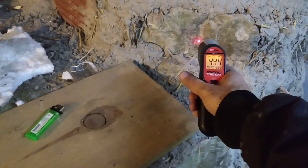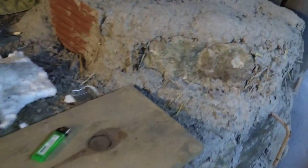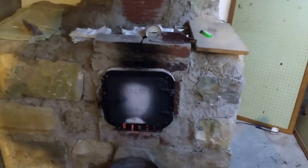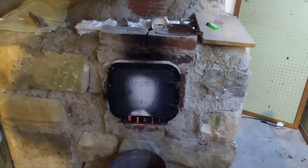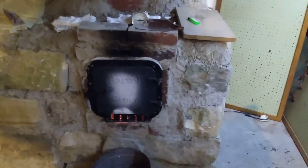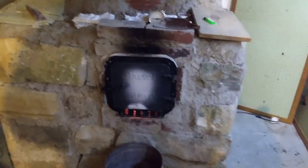This one's only about 3 inches thick and it's already 101 degrees. It's 230 degrees now — warming up pretty quickly. The stove itself performs really well. Materials are brick, limestone, clay, ash, ceramic fiber blanket for insulation. Underneath the base of the firebox, under the brick, I used rock wool mineral wool insulation. It's not in direct contact with the fire so it shouldn't melt out. I haven't had any trouble with it collapsing, so I don't think it's a problem.